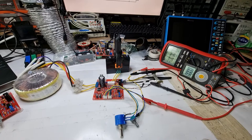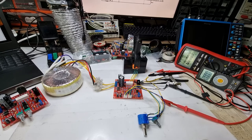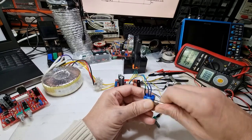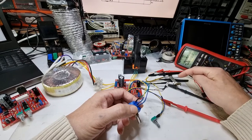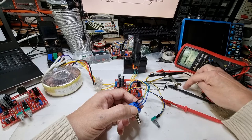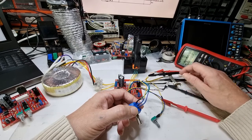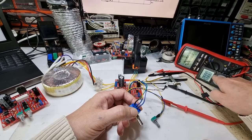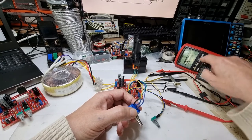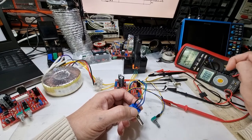Here I have a genuine Highland board and I'm going to show you what it's supposed to do. First of all I'm going to wind this down 10 turns. What we've got here is a 10-ohm resistor. We've got a voltage meter connected here and here, and we've also got a current meter — coming from the positive through the meter, back through the negative through the resistor.